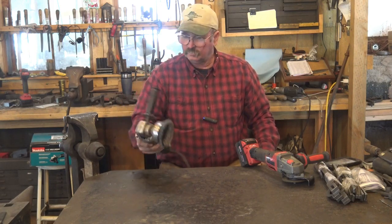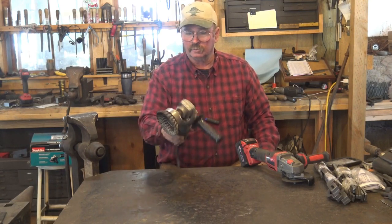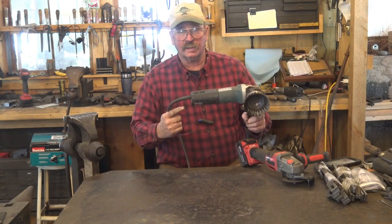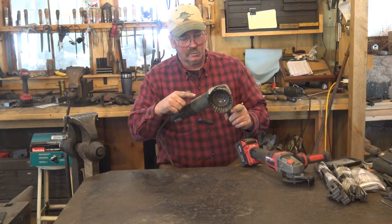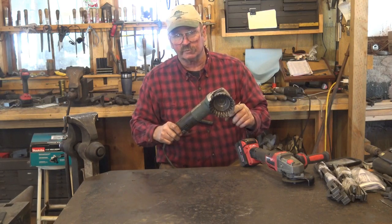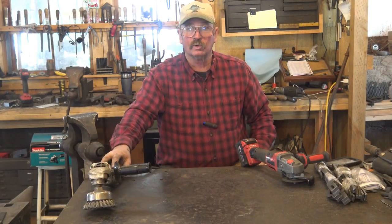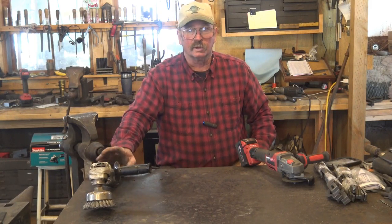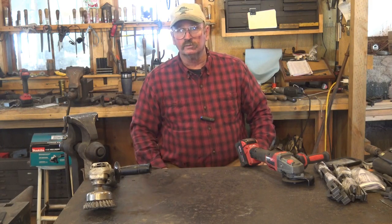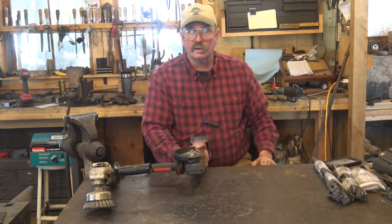But there's a solution. This isn't really an angle grinder — this is called a polisher sander, and it looks just like an angle grinder. It's every bit as well built as a Makita angle grinder, it is made by Makita, and it's a great tool. It's got variable speed so you can turn it down and make it a lot safer than running a regular wire brush. You should also always use guards on your angle grinder. For wire brush work, I really recommend these sander polishers — yes, they're more expensive, but they are way safer and you'll get much more control.